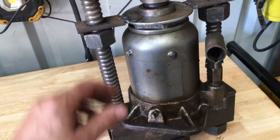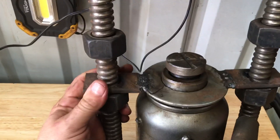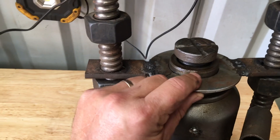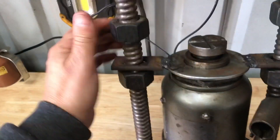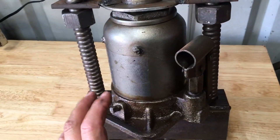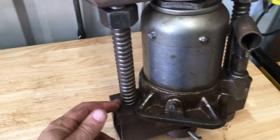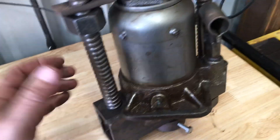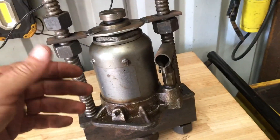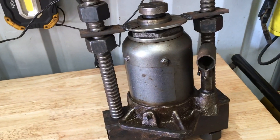What I've got works pretty well. The cylinder is able to slide up through the middle, and I can tighten these nuts down to hold the jack against the bottom plate of the press, which makes it more stable. I need another nut on this side here — that would keep everything straight. This is a pretty handy tool — you could actually clamp this in a vise, use it upside down, or if you're out in the field and need a press, this is a compact 20 ton press. You could press U-joints, just about anything.